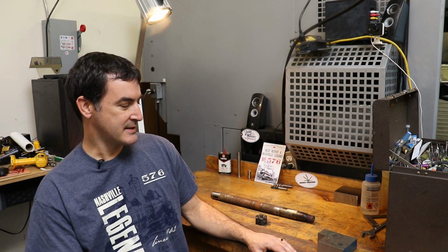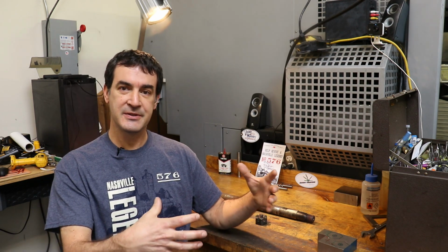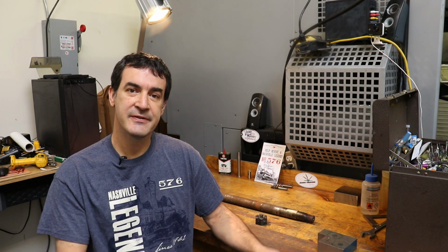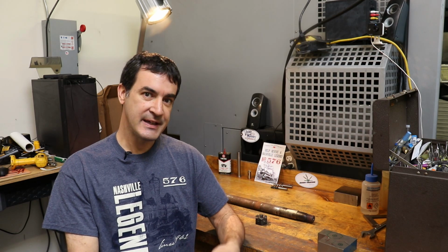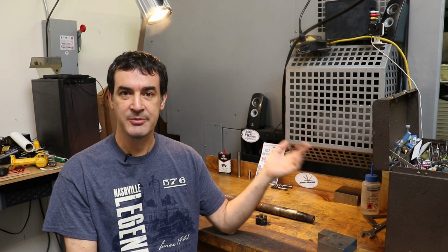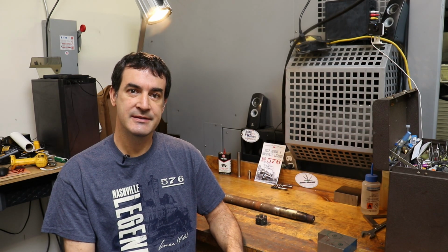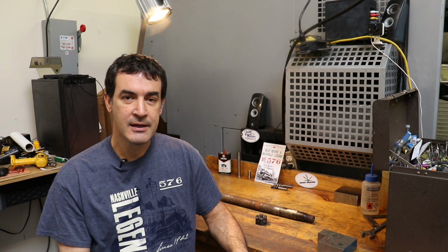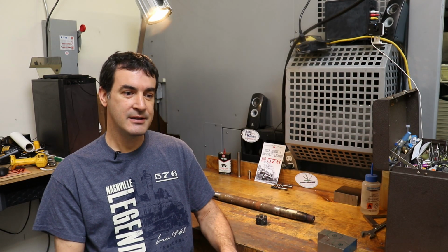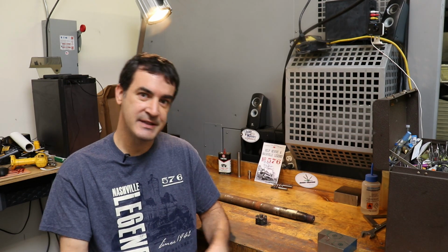In that series, you can see how this Stoker steam engine is used to power a screw auger in the coal tender behind the locomotive itself. And the screw auger feeds coal into the firebox in the boiler of the locomotive, because this locomotive was so big and powerful that a human couldn't shovel coal fast enough to keep it going. So this probably several hundred horsepower steam engine, which is considered an accessory in the coal tender, loads coal continually as the locomotive goes down the line.